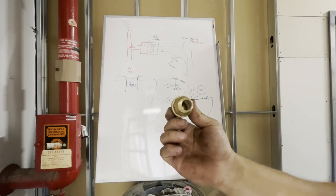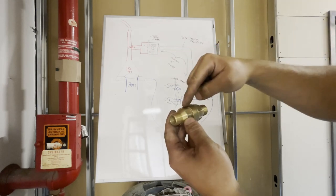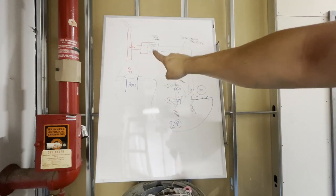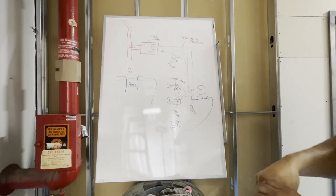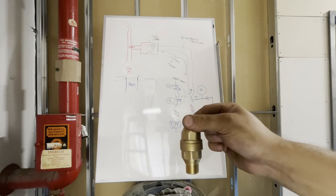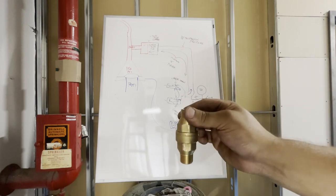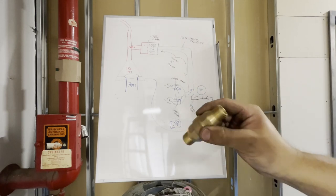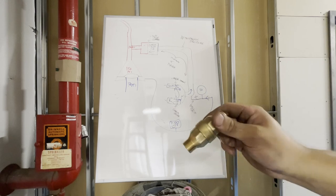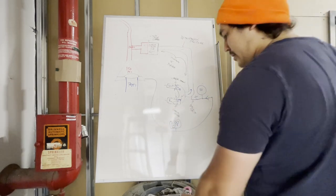When it's not under pressure, that ball just sits in the middle and we can actually see daylight right through it. So small amounts of water — if, say, that check valve way up high is passing water — we'll know because it's going to start dripping down here. If you ever see these things dripping constantly and they never stop, you have to call someone in — maybe they need to service the check valve or replace it. Now that you know how this works, it's obvious: you cannot install this upside down, you cannot install this vertically. If you install it vertically, that ball is always sitting on the bottom part of the concave so it's never going to drain anything out. Horizontal installs only.